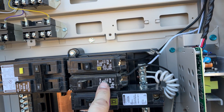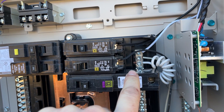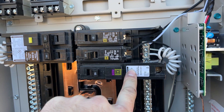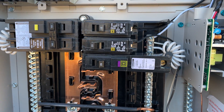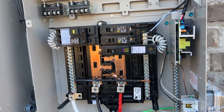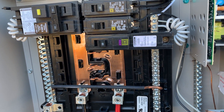The 20-amp circuit is for the existing outlets as I described. There's also a 20-amp circuit for pool lighting — a dual-function GFCI/AFCI breaker. You only technically need GFCI per code and manufacturer recommendation, but I went with the dual function because it was just as expensive — so why not get the AFCI too? Our pool went with 12-volt lighting, so there'll be 12 volts in the pool for the lighting, running to a transformer mounted on the wall.